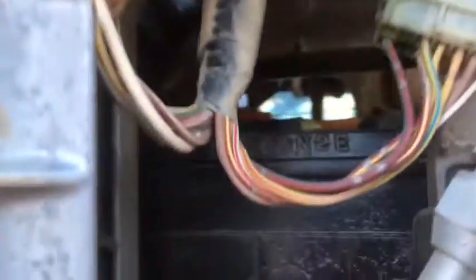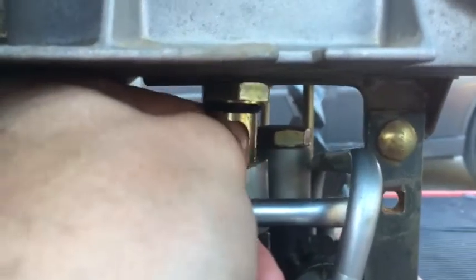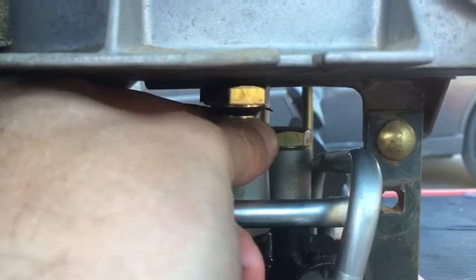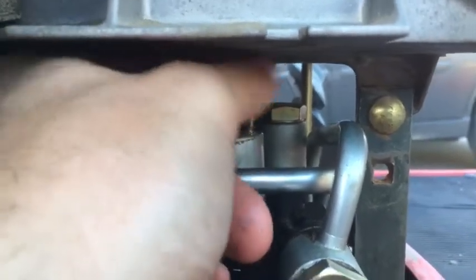Okay, so I got the bolt, or the little valve, unscrewed, and one more problem I've run into here is the battery box, which is pretty integral to the whole thing. It's bolted everywhere, so I can't undo it. It's bolted up there and holds the dash up. It's bolted down to the frame. It's bolted to each other. You can't really get it off very easily. It's in the way. I can't lift that out to replace that O-ring, which you can see is damaged. You can see how it's squished and torn there.